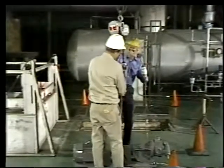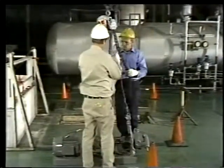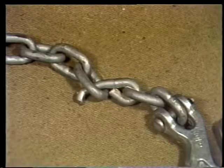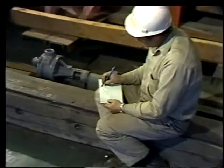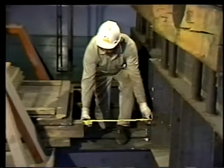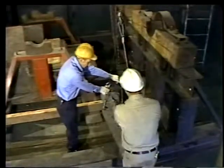Hoists, chains, hooks, shackles, and adjusters are the tools of the trade. As you gain experience in rigging, you'll learn more about them. The simple facts you already know: every piece of rigging equipment has to be inspected before each use. Any single equipment failure, a stripped out shackle, or a single defective link of chain can be deadly. You also know how important it is to plan the job thoroughly. Find the weight of the load, check its balance, and measure clearances so you're sure you've got room to move the load. Rigging safety is a combination of all these factors: planning, equipment, and good practices.